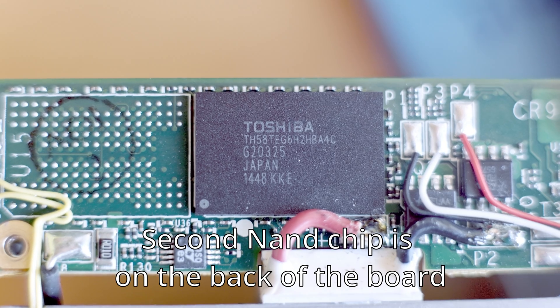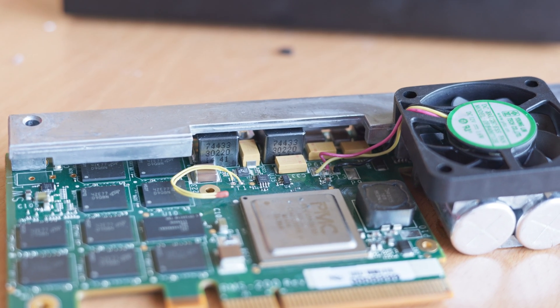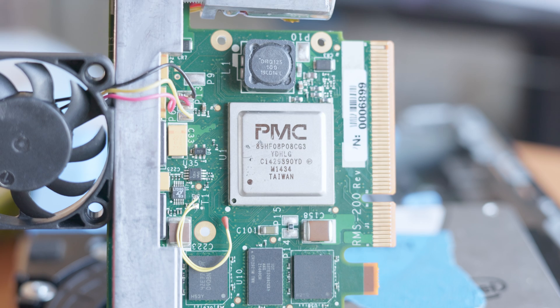Near the capacitors on this board, there are two Toshiba NAND chips that work as non-volatile storage, so the system can store data without power for as long as you could want, staying stable on these NAND Flash chips. There are also quite a few power delivery chips on this board, likely because it has to handle a lot of charging, discharging, and power conversion for the different components.